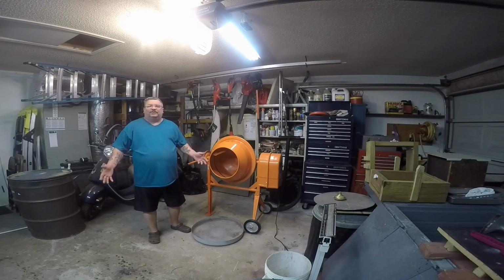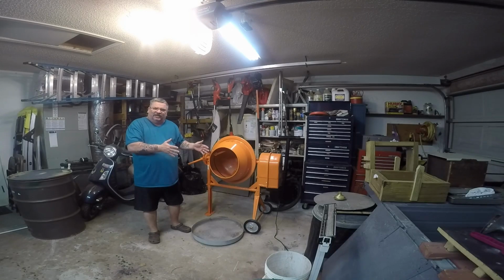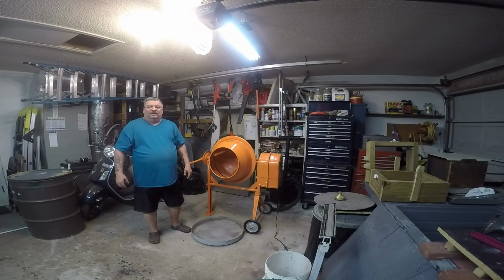Okay, today's little episode is going to be making all-purpose sand. This is going to be synthetic sand. If you watch the video on sands, you'll remember that synthetic sands, as opposed to natural bond sands, are sands where we human beings take the different ingredients and put them together ourselves to make molding sand after a lot of experimentation.